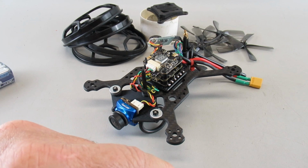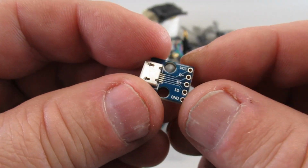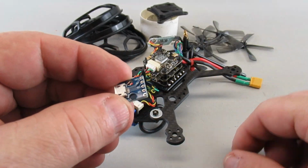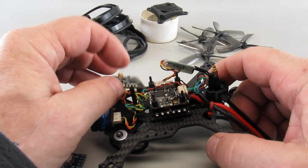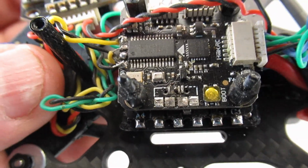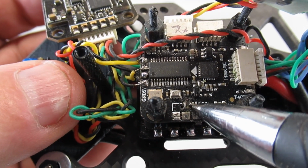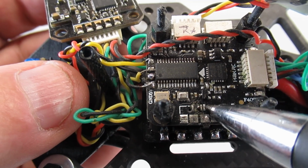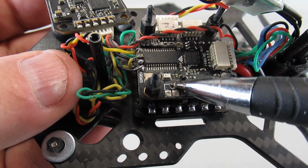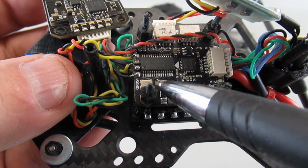Well, in the process of taking it apart, if you also remember, I was using a remote USB connector, 4 wires off of this tied into the controller, and I'm sure you know that the pads on these controllers are small. I had it soldered into these. These were the 4 pads. Well, it turned out that the wire had ripped out and it actually pulled the pad with it. There's nowhere else to connect in.